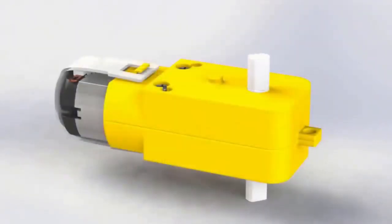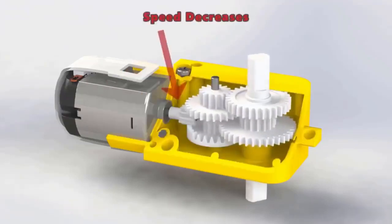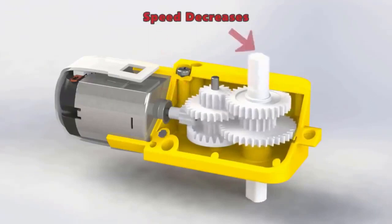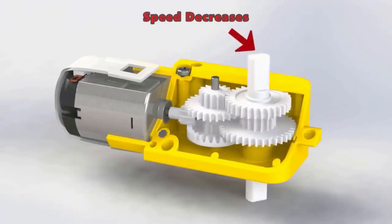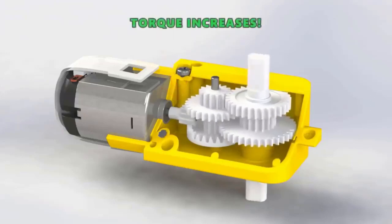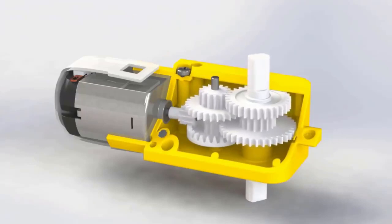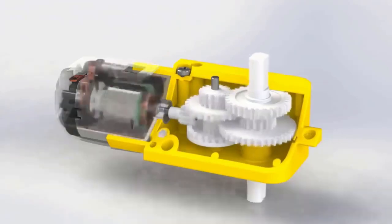This is basically the double shaft rotating at a very low speed. You can see the speed decreases at two points because of the gear ratio. There are two gears where the speed is decreased and the torque is increased, apart from the original input.